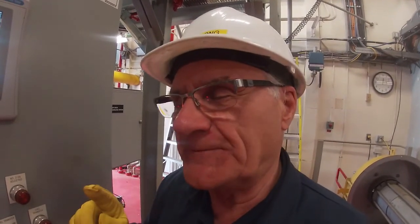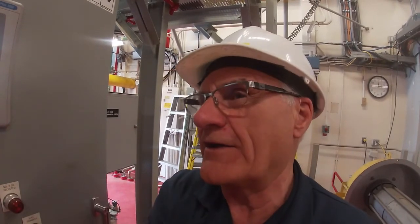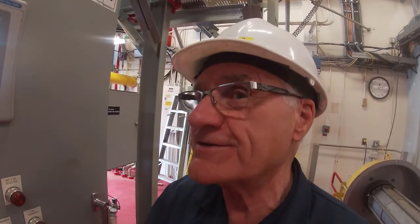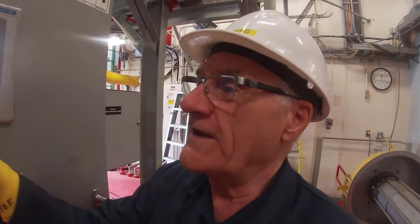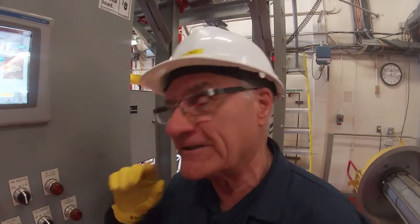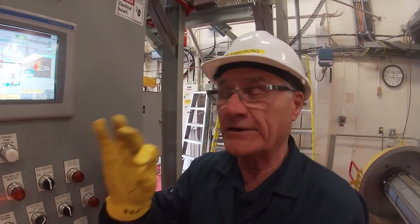And because we've got flue gas recirculation, those flue gases would come around and go into the burner, and they are corrosive. They've got acids in them. So we don't want that in the burner. Secondly, they would fog up the scanners, and we would lose flame indication, and then it would shut us right back down again. So this will not release until you're up to 105 degrees C. That guarantees that the gases are hot enough that the vapor will stay in a non-cloud form.